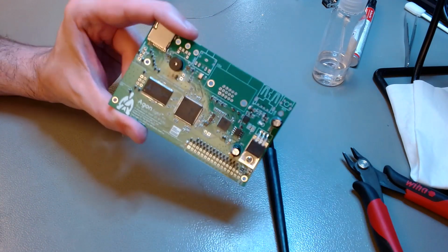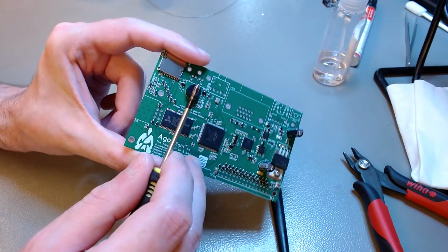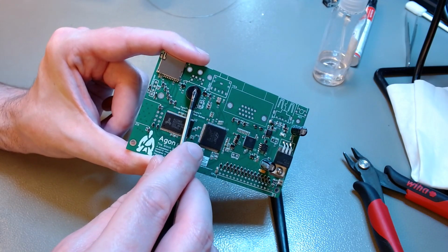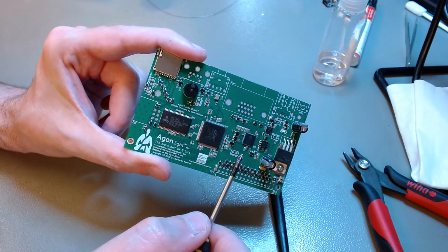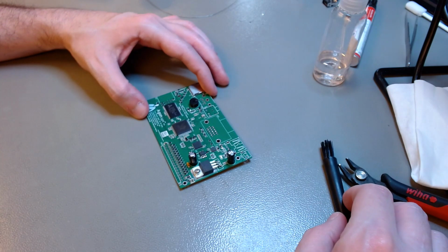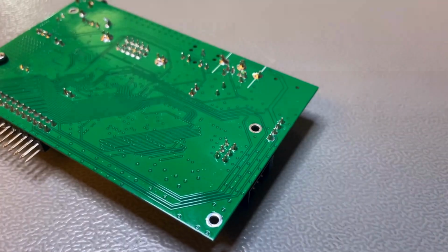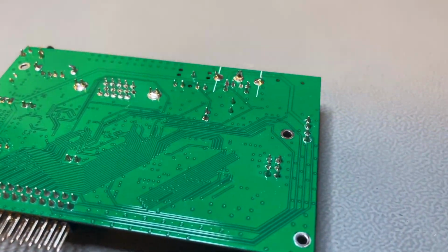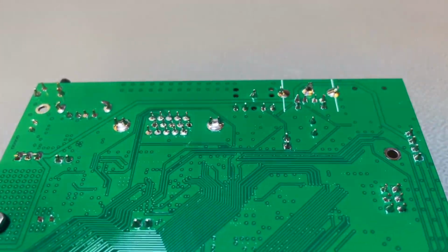If you have an ultrasonic bath, then you know your stuff. You don't need to do what I'm doing now. You know how to do it better. But in that case, don't put this buzzer before the bath. Do the bath and apply and solder the buzzer at the end, because you don't want water to get into that cavity. It may damage the membrane of the buzzer. And if you have an ultrasonic bath, you're probably not watching this video anyway, because you know your stuff.